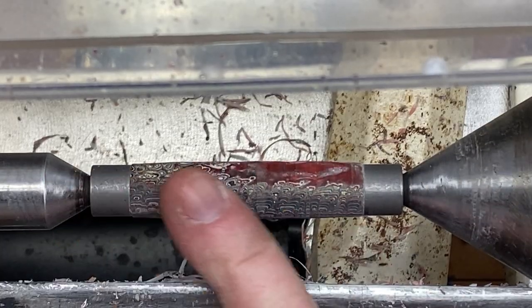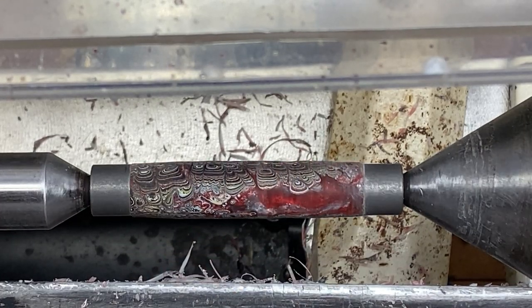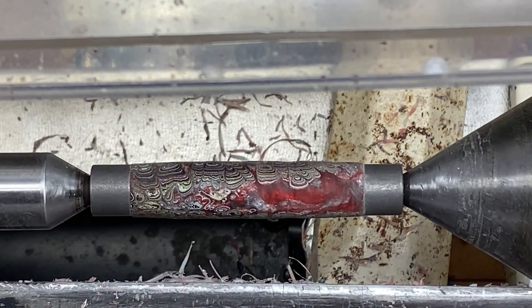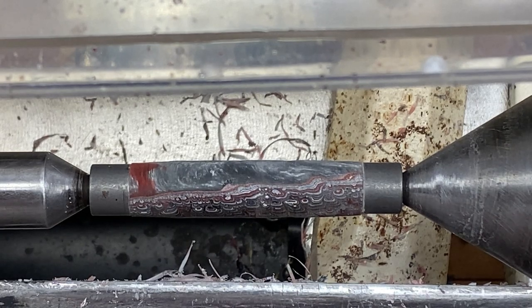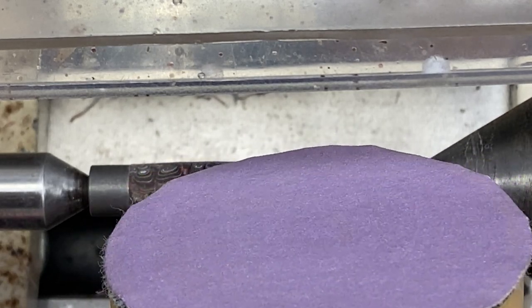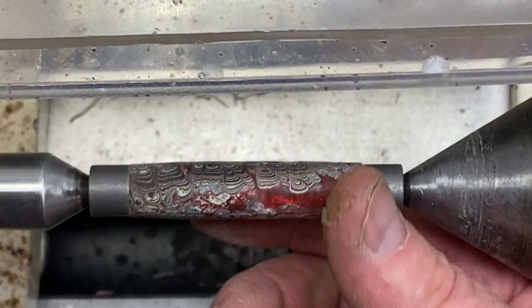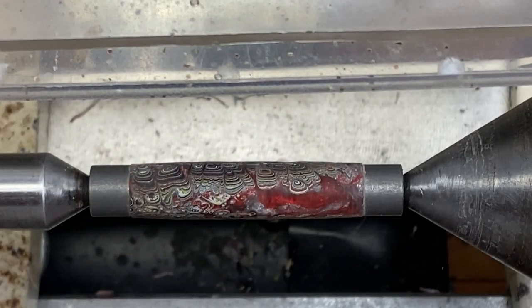The turning process was really slow and really boring — I just took my time and barely took cuts. I didn't want to get deep at all because I was scared I'd blow this thing up. It's a little proud of the bushings on both ends but I think I'm going to stop there and use a little sandpaper and clean this thing up. I don't want to take a chance at destroying it this late in the game. I'm going to be using this sanding pad with hook and loop discs — 120 all the way down to 600. You've got to be careful when using these because they will remove a lot of material. I use them for larger turnings but I think we'll be fine for this as long as we don't get aggressive. Let me get the dust collector on and we'll get to sanding.